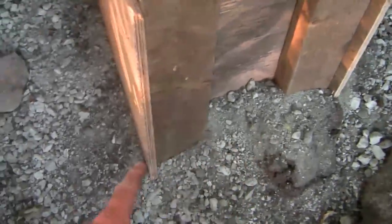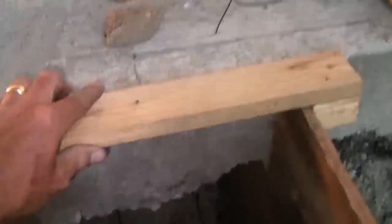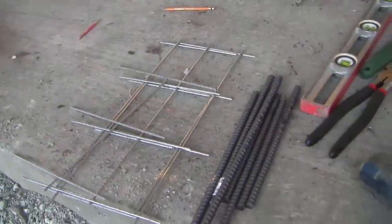All right, I've got it done now. I tied it to the ground with some rebar into some screws so it doesn't lift up when the concrete is poured. The angles were a bit tricky underneath, so I'm going to have to fill that in a bit more with gravel so there isn't as much spillover. Looking inside, you can see I've got some water ties in here to the base and a couple of wire ties holding the insides tight so it doesn't splay out when the weight of the concrete comes inside. In addition, I've got some rebar and some additional wire mesh to add in as the concrete is poured.